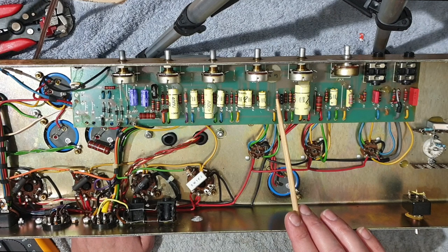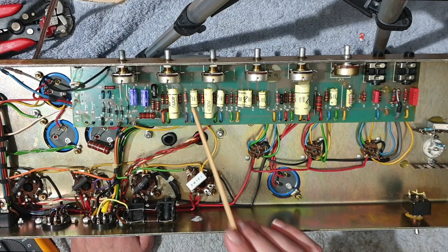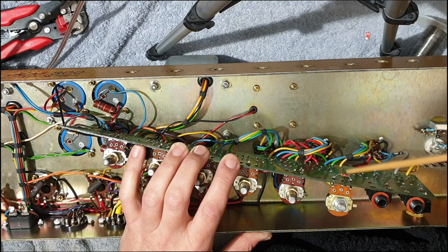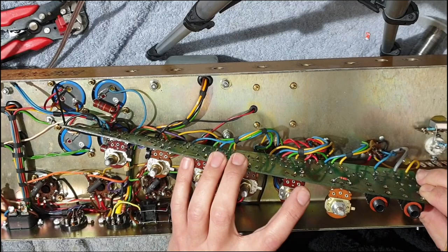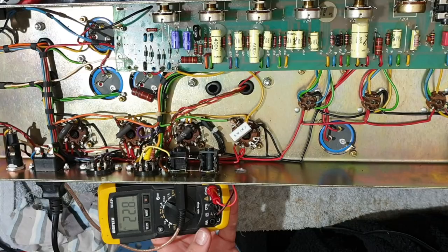The 100K negative feedback resistor - I've moved that to 47K, so we're going to get more negative feedback into the amp. Here's my fixed depth - 220K resistor with a 4.7 nanofarad cap. Very common to see that kind of arrangement when you just want to set up a fixed depth - 4N7 with a 220K, you can't go wrong. The other change is the 220K resistor across the first gain pot here. I was planning on putting that underneath the pot - that's what I've done. You just run that from the input to the gain across to ground.